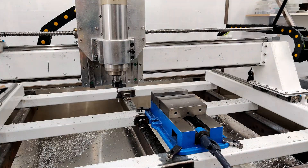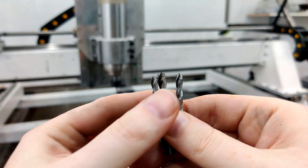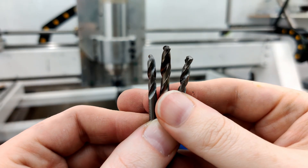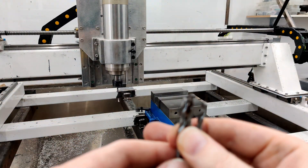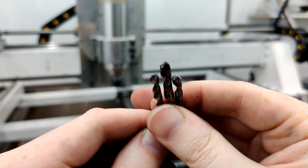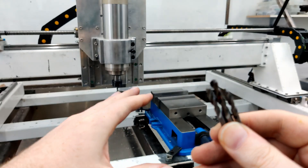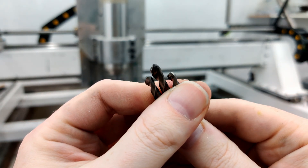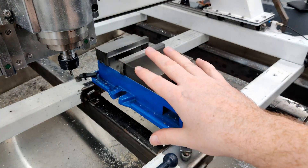Here are some carbide drill bits at 4.2 and 5 millimeter — these are great but you need a really rigid machine. The tips can shatter easily. I damaged all of mine on the CNC machine when it had issues with the gantry risers and was far less rigid. With the current setup I think carbide would do much better. On a less rigid setup, you might want to consider HSS for peck drilling because HSS can flex and is very forgiving — it won't shatter, whereas carbide will just break the tip if it catches badly.